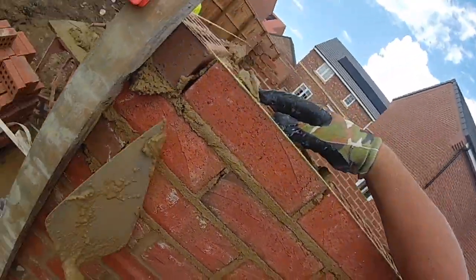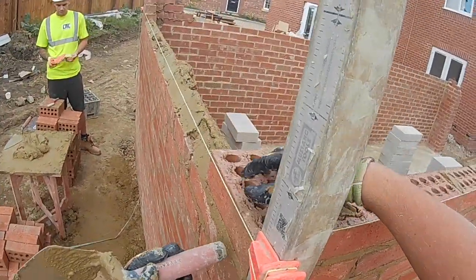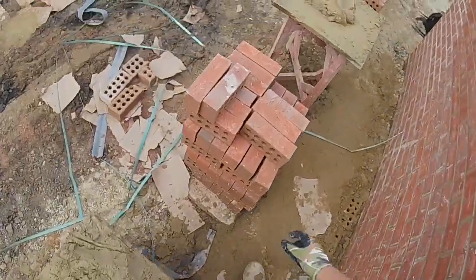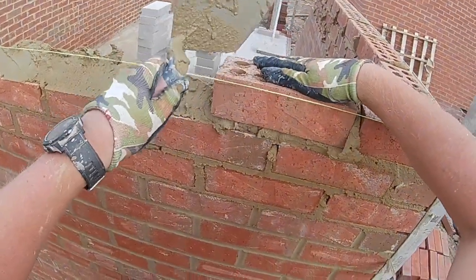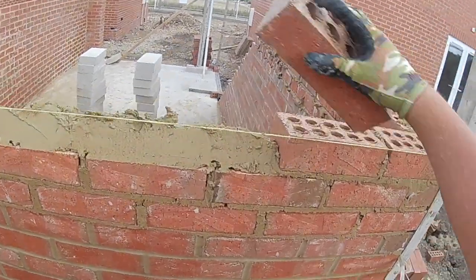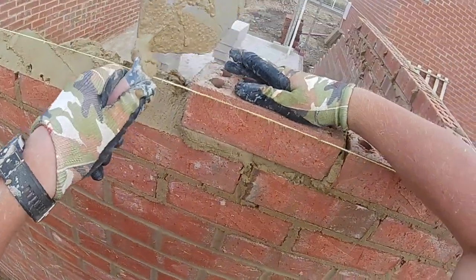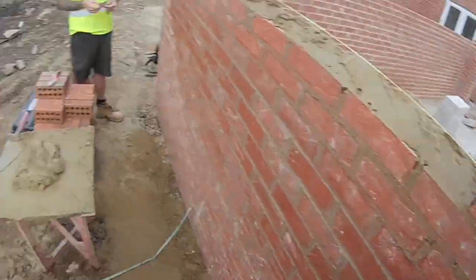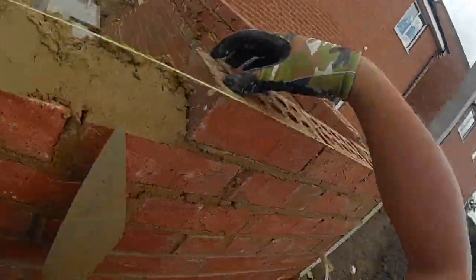I'll probably do a garage like this again. It was quite fast. Building the back and then building the front pillar, the back and the gable, and then the front pillar again. It was really quick. I got the front pillar up in like two hours on this last one, and the rest of the gable. I find splitting stuff up into big corners really helps, especially pulling big lengths with a line. It just helped cut down on pointing, to be honest,